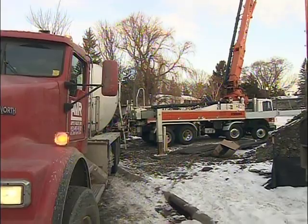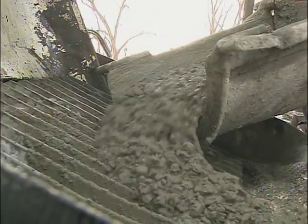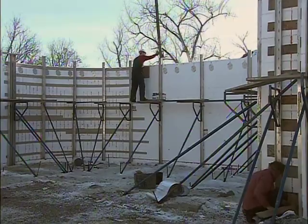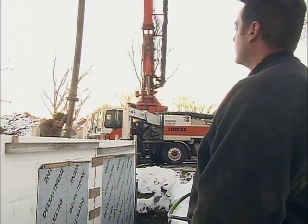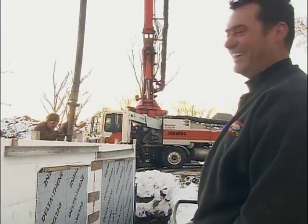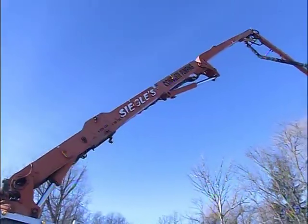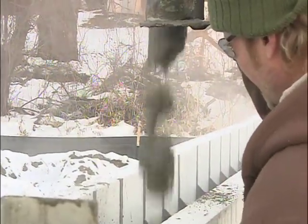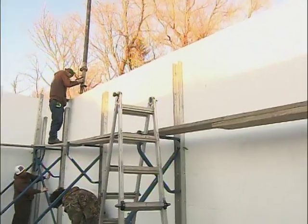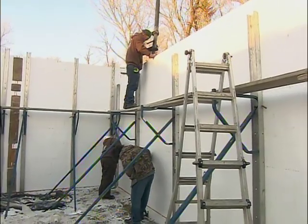Here's the way it's all laid out today. We've got the ready mix trucks starting to arrive out on the street. We're figuring about nine loads over the next four hours to pour all the forms. We've got Jeff Siegel's concrete pump station here to take the concrete and send it out on the hydraulic boom to where the forms are. That's where Brad's got his crew controlling the pour and working the concrete as it goes into the middle of those ICFs.